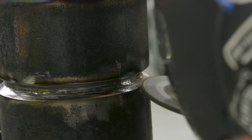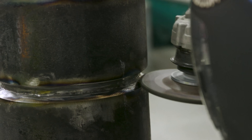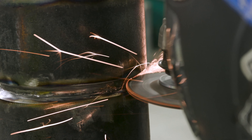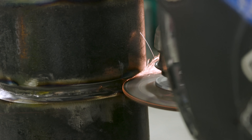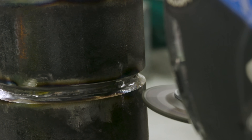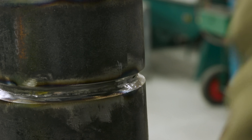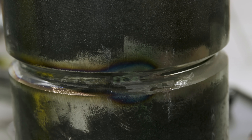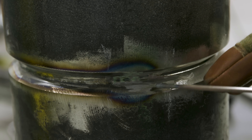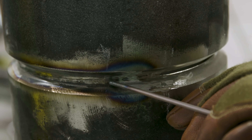Some people take it all the way through and get rid of it. I usually just grind until it gets thin. If I mess up and it goes through, it's not a big deal — this is the way I do it. I reshape this best as I can, grind a little bit back so I can have a good tie-in. When the metal turns blue, that's the first sign it's getting thin. When it gets cherry red, get off of it. I'm going to grind a little bit more right here and feather this out for a good tie-in.